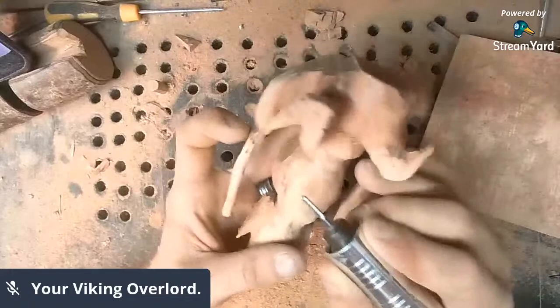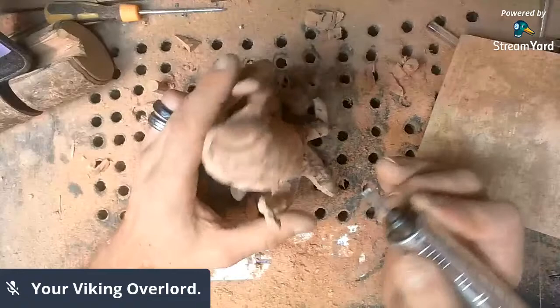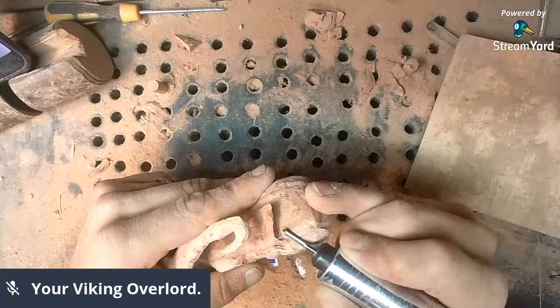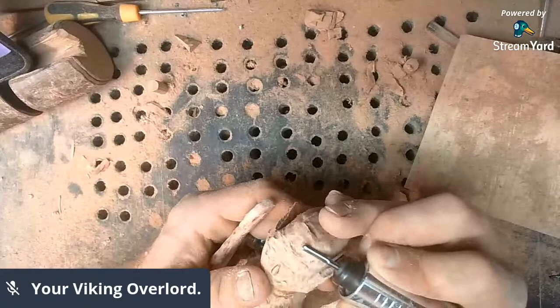Yeah. I mean, CBNs have an advantage because they sharpen much cooler, so you don't get the sparks and you don't alter the molecular structure of the blade. But if you're careful with a stone wheel, if you don't press too hard and leave the edge on there for too long, you're not going to damage the blade. It just becomes about technique then, doesn't it? You've got to get really hot to start damaging the blade anyway. Yeah. If your blade starts turning blue, you've done something wrong.